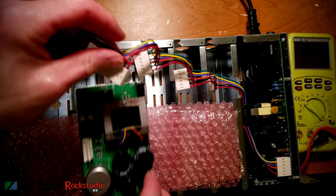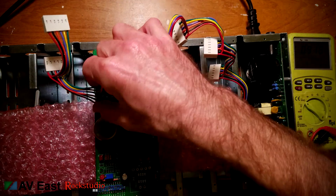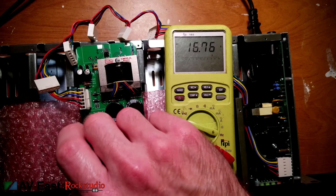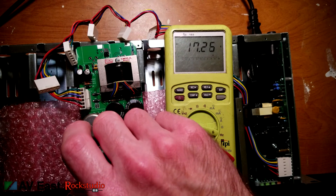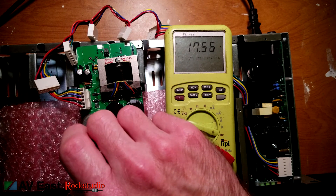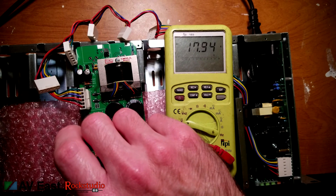Now we started having some real fun. My chassis came pretty much assembled already with the power supply installed — all I had to do was hook up the power distribution lines. I put some anti-static bubble wrap down and plugged everything in. Now I'm going to start tuning the local power supply resistors. The op amps I chose were designed to run at 16 volts, but you can actually push them up to 20 volts plus-minus DC if you want. I initially set these to run at 18, but when I was done filming I turned it back down to 16 to be on the safe side.